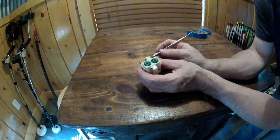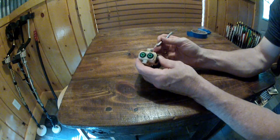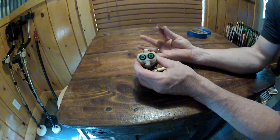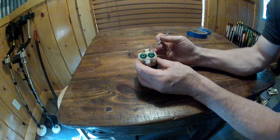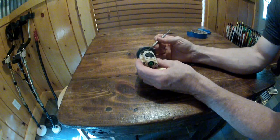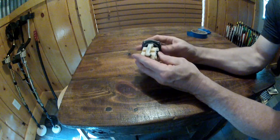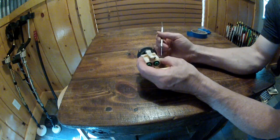One other thing I did in an earlier experiment was pull out the ports — they just pop right out — and inside are the backflow preventers. I took them out thinking they might be the cause, but putting it back together, that didn't change anything. This spare cartridge doesn't have its backflow preventers, so I'm going to save it. The cartridge currently in the shower is the original one with the o-rings removed — without those o-rings, it can't try to regulate water pressure, and the water just flows like an older-style valve.